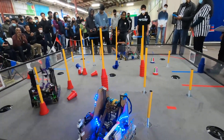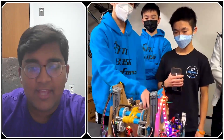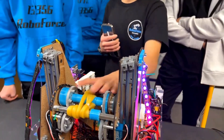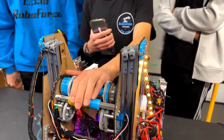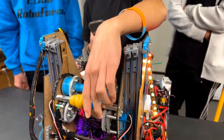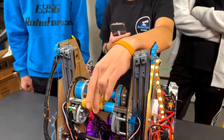It looks like there's some counter-springing going on with that bundle of surgical tubing. How did you develop that, and have you noticed any fatigue issues? So this was added later in testing — we actually broke a few of our virtual four-bar servos mainly because of torque issues. We added this surgical tubing counter-springing to help the virtual four-bar servos. There's also a second one that keeps the gears meshed, because with this wood there's sometimes a little bit of flexing after extended use.